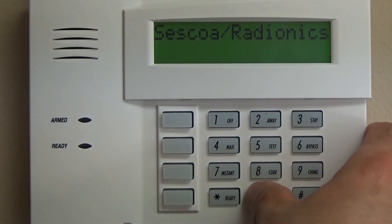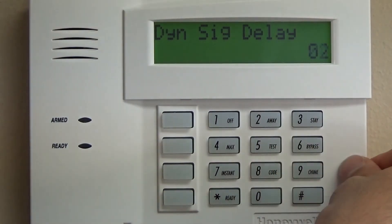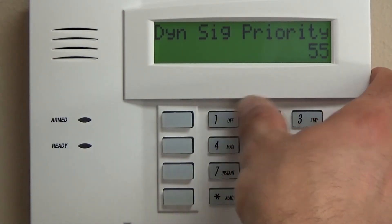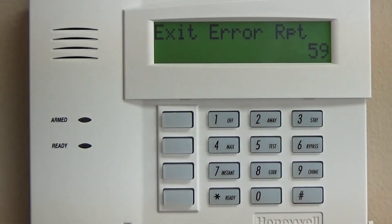Star 53 is going to be zero. Star 54 is going to be two. Then we jump to star 55 — this depends on how your system is laid out. If you have a cellular communicator, you're going to input a one. If you have a telephone connection, you're going to input a zero. So for this example with a cellular communicator, we input a one. We're going to pick up the next video on star 59, where we'll continue. That gets into trouble reports and how to report low batteries and similar topics, taking us right through star 95.